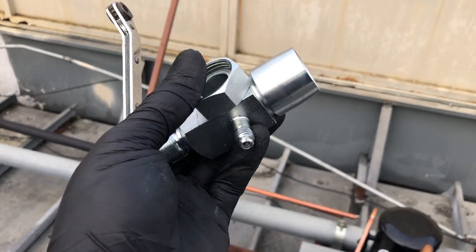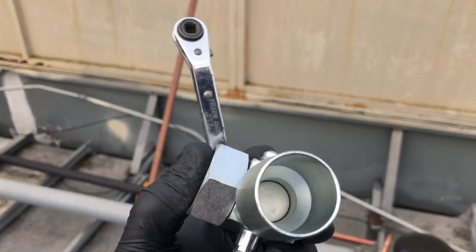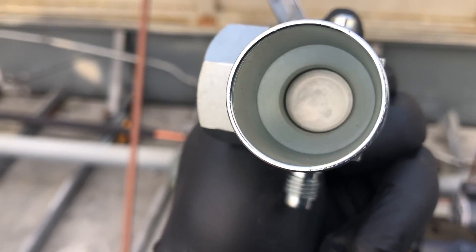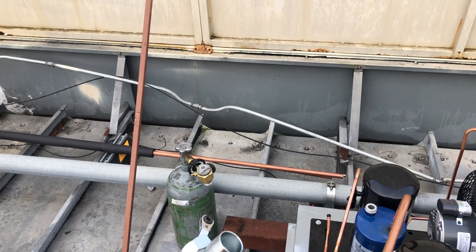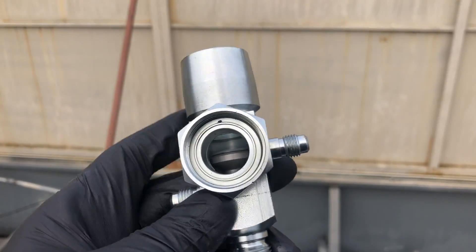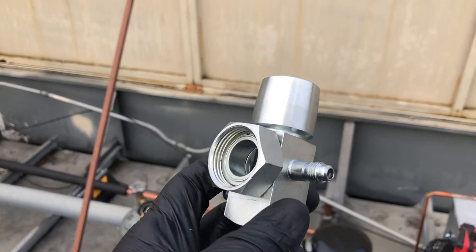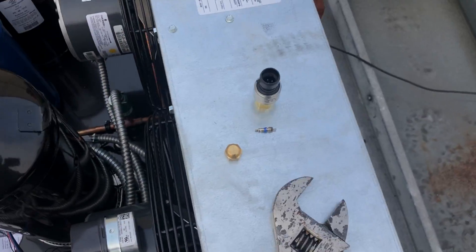Before you make your silver solder weld on your suction service valve, make sure you backseat the valve. They come front seated - you get heat on there sometimes when they're front seated and they will not come apart. It wreaks havoc. So make sure you open this up and get that valve backseated. I can get it where the valve's in the middle like that, then I can get it all prepped and ready for doing my stainless to copper silver solder - I'm going to use the 56 percent. Also, there was a Schrader in there for the transducer - you gotta take that Schrader out. The pressure transducer was mounted on the side of the valve so you gotta take all that off before you braze, so you don't melt things up.